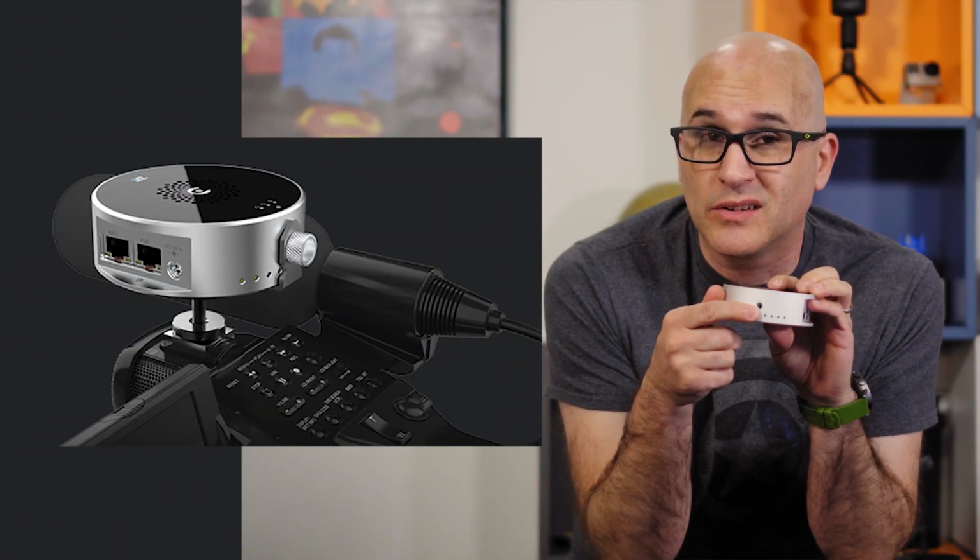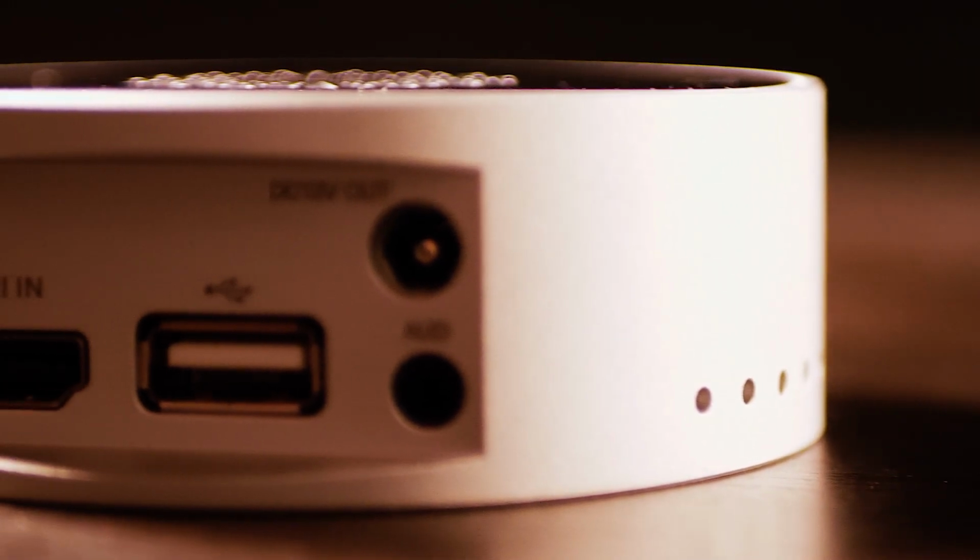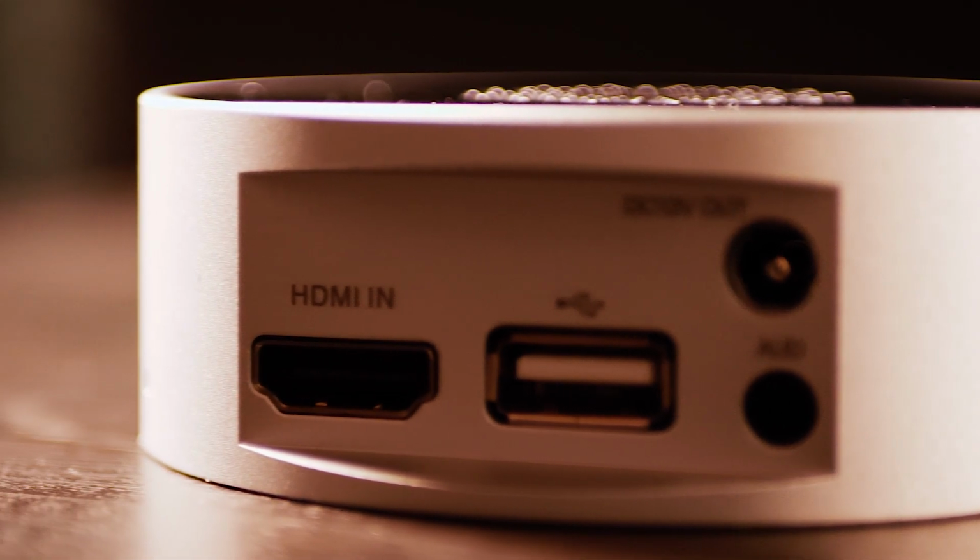The U40 is the first major departure from the standard box-like designs of other NDI encoders. I mean, it's a sturdy block of aluminum, and like other NDI encoders, it has tally lights. Unlike others, it has them on the front, the bottom, and the top. It also has a 1/4-20 mounting thread, so it can be mounted just about anywhere. The U40 is a full NDI encoder, and for those of you scratching your heads right now, that means it has the least amount of compression and delay that NDI has to offer. Most importantly, this is a UHD HDMI encoder, so it can handle up to 4K 60p on its HDMI port. Now this thing is punching way above its weight class.